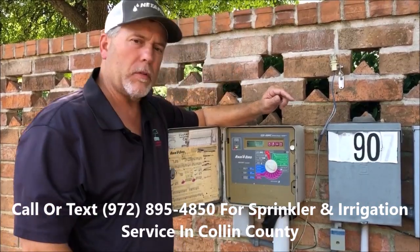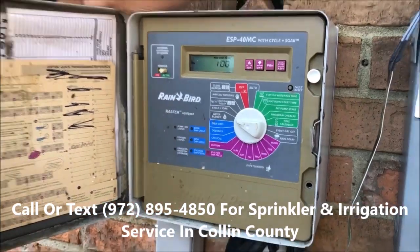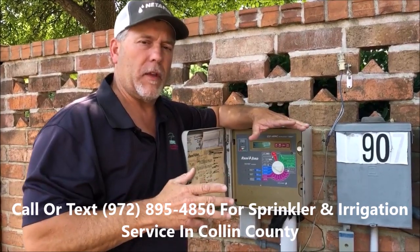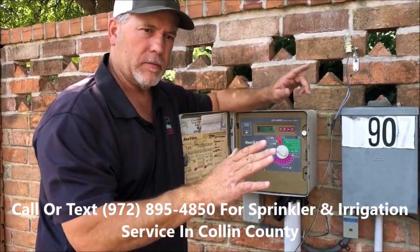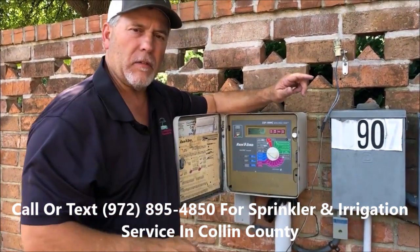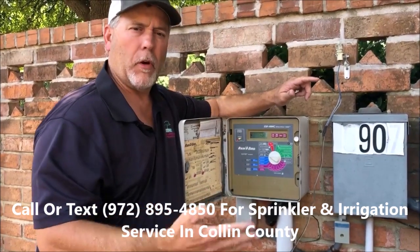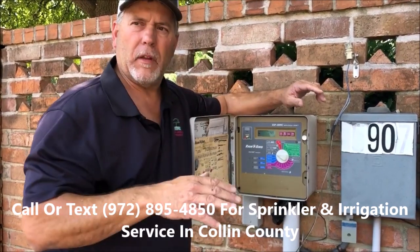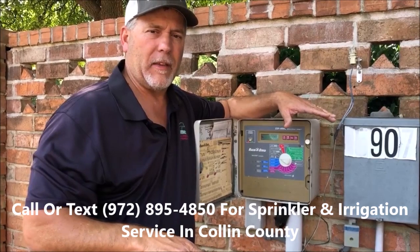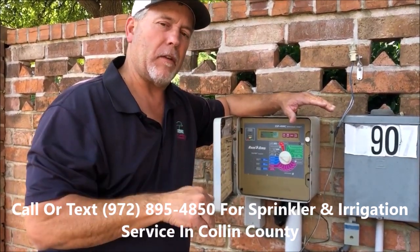Water budget is really important — you may have this feature on your controller. At 100%, if you've set your sprinkler zones to water for seven minutes, it waters seven minutes. If you wanted to increase it, say double, you mark it up to 200% — so instead of seven minutes you're watering 14. That may be okay, but all areas around the yard are not going to need a markup like that. Some may need a couple extra minutes, but we always usually go down, not up.